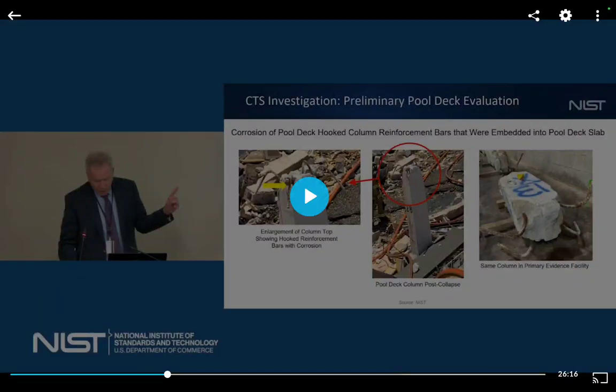I want to give you another bite of the apple here with my information. This is a true punching shear failure and not a critical shear zone failure around the critical shear zone, which is really a tributary failure. I'll show you what I mean in a minute. Here's a critical shear zone — let me give you a drawing first.